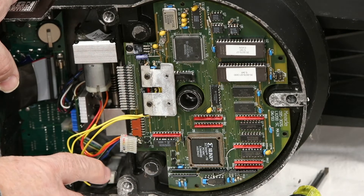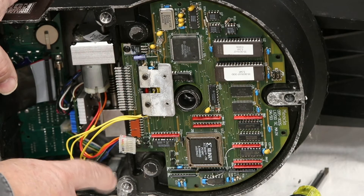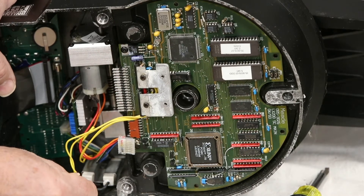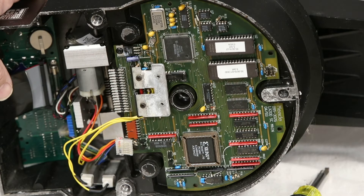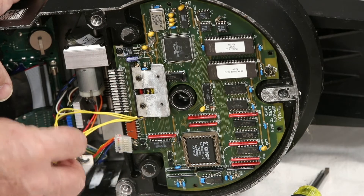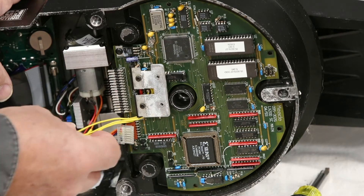Some of you that have the newer ones will have this ballast resistor blank. You can take it by taking a screwdriver and prying underneath the stainless steel section and just prying that up. It's just glued on there with two-faced tape, and I will be supplying new tape. So all you'll have to do is clean that up with some isopropyl alcohol before you stick the ballast resistors back on. Sometimes these have a tie wrap, so you can just cut the tie wrap and then that'll be loose.